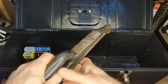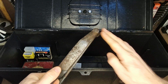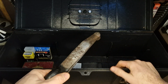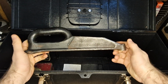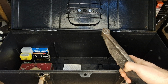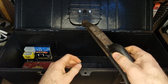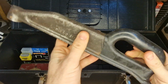And this one's so heavy, I've got another one that's a little bit lighter, but this one's so heavy you can give it a really good whack with not much distance. But if that's not enough, then that's where you bang on this bit here and just whack it down, and then the nails go down really, really well. You know that you've secured it properly. It's a great tool to have. It's got a nice little magnet on it, so that you can actually put the nail on there as well and just pass it under before you do it, so you can really locate it in the right place. You're not fiddling around putting your fingers in the way of it. It's a great tool.